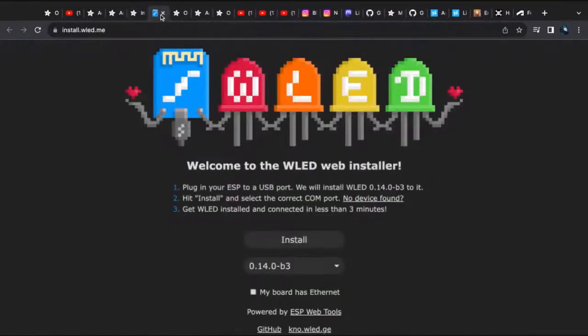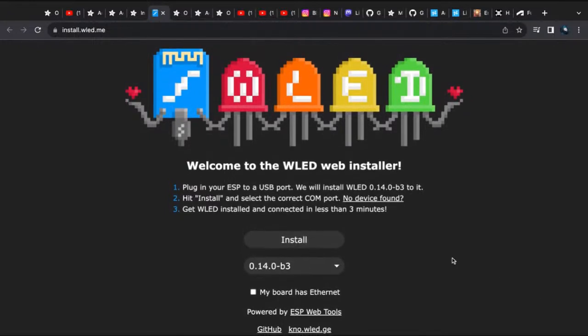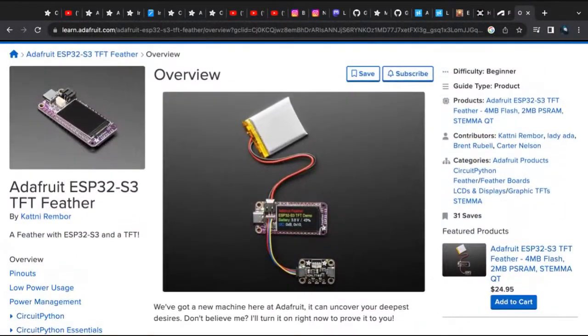It's fantastic — definitely check out WLED. It even supports the ESP8266, the kind of legacy ESP board, so that's really nice too. They're working on trying to implement the S2, S3, C3, and all those variants as well. But for right now, the vanilla ESP32 and the 8266 work really well with WLED. So if you just want something that has a ton of LED animations and no programming, that's a good way to go if you're doing an arts installation or something. With the S2 and S3 variants, there's a few different boards that Adafruit makes — my favorite is there's a Feather TFT. There's one that's front-mounted and one that's back-mounted that has buttons on the side, and it's really good for quick IoT projects where you mainly just want to log data or get data and then show it. We actually use it as a monitor for our OctoPrint.